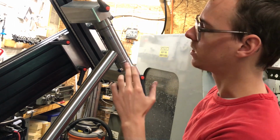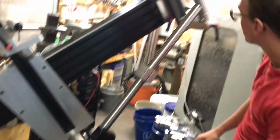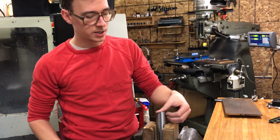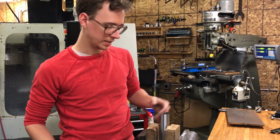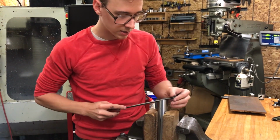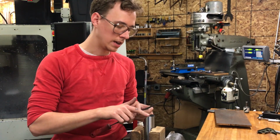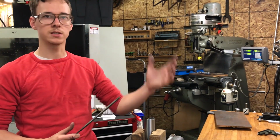So maybe just touch that up with a hand file since the shape is already there and I've moved the tube block. But yeah, another little millimeter cut or something, and we'll be getting in closer. So getting old school here, I'm just going to use the hand file to dress this a little bit, take a little bit off of this top edge, and carry on with the cuts down there. There's all different ways you can do this, but I know this will work. Just hold the file at the angle of the head tube, and put pressure on it so it's only cutting on the back side. And anything behind these sort of ears, if I just do a little bit evenly, it'll sit a little bit nicer in there.